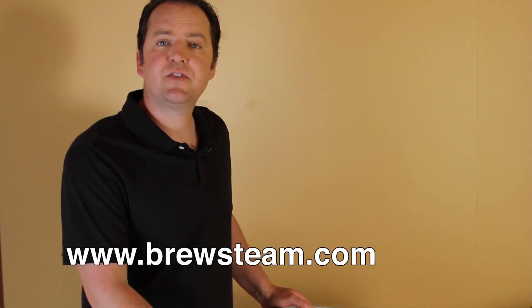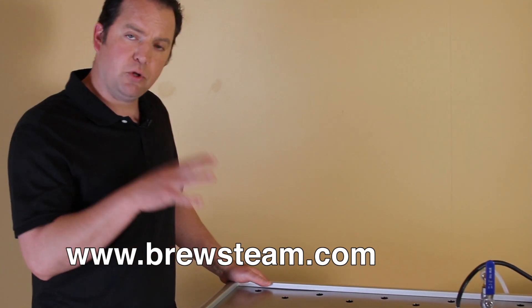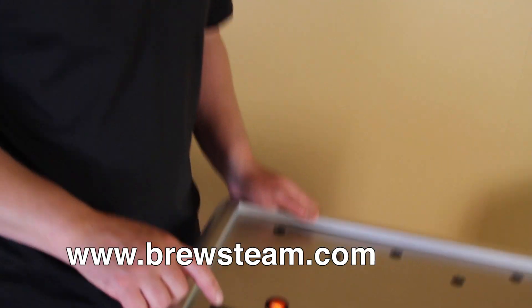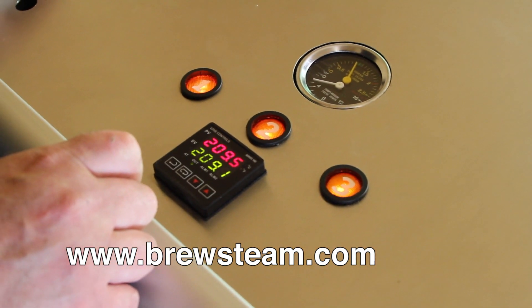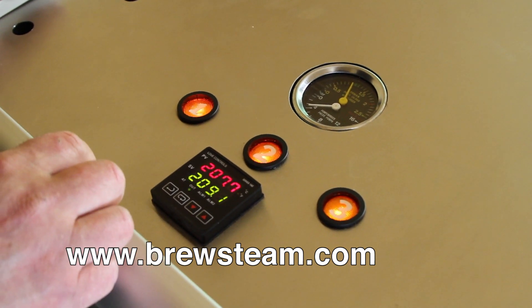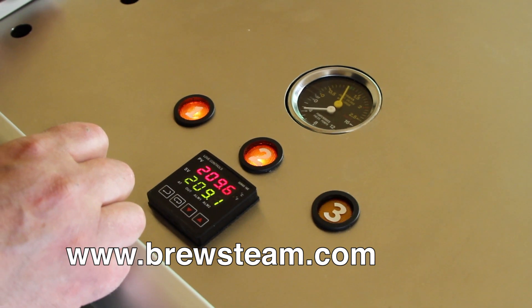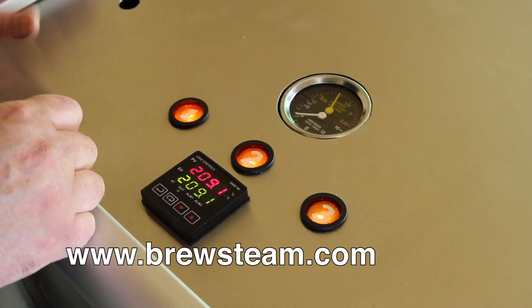It's been about 10 to 15 minutes, and right now what's happening is you can hear the computer cycling the steam on and off — that's where you hear the clicking. What it's doing is using the fuzzy logic inside the computer to try and maintain or reach the temperature without overshooting it or undershooting it. So it's actually pulsing. We're running that off a solid state relay, and what that does is give us a perfect level of control — an infinite amount of cycles in order to maintain the right temperature. It's going to get very cautious once it gets close to the 209 target temp. It may overshoot a little bit, but once it finds the perfect temp, the computer will figure out how to maintain that within a half a degree. That's why they call it fuzzy logic.